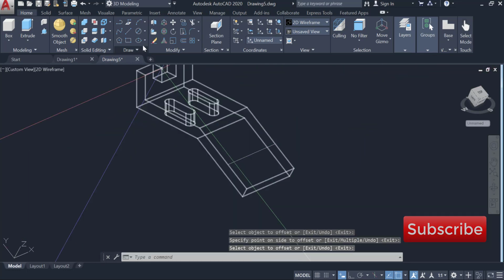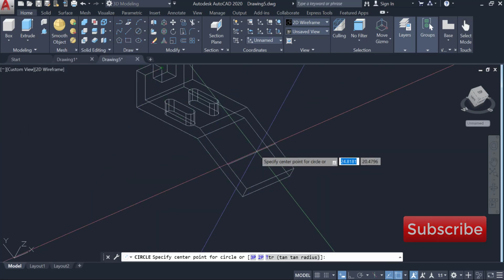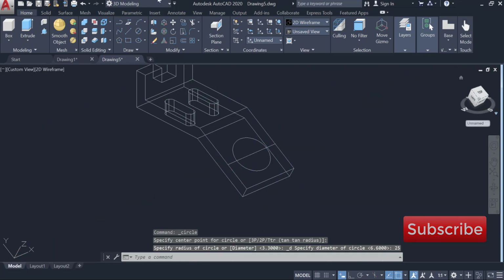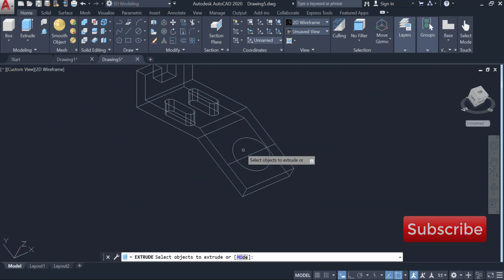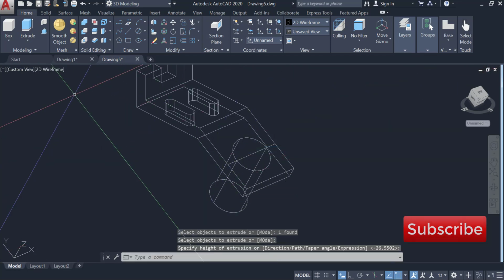Okay, we'll set it at 20 and draw a circle of 25 diameter. Draw circle center, diameter 25. Okay, so extrude it down to any dimension because we need to cut it. We need to create a hole there.